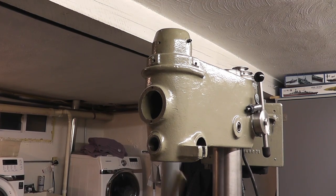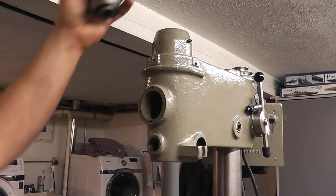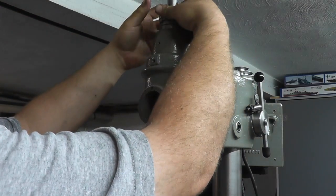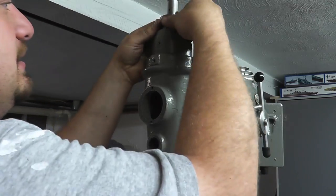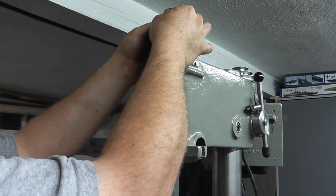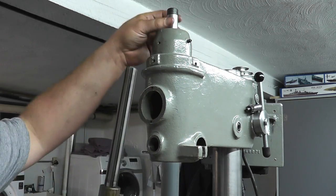We're back over at the drill press, ready to put everything together. The one thing I didn't show you is you've got to put that lock collar back on the spindle. What we're going to do first is drop our pulley bearings in place here — I'm just trying to line up the little screw marks. These screws bear on this ring, so this should just go in by hand. I don't want to tighten these up yet because there's a little bit of wiggle in it, and these splines have to mesh with that, so I actually want to put the spindle in first and get the splines all set.